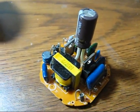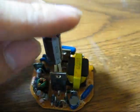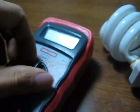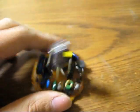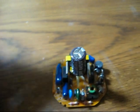As it turns out, this ballast circuit board I cut out of the top light compact fluorescent bulb is still good. I tested this part with my ohm meter, and as it turns out, the electrodes on this end — which is burnt — has actually failed open, so it wouldn't start. I'll be putting this in my parts drawer, and someday it'll probably find its way into another fluorescent light.